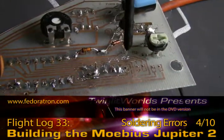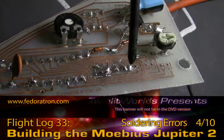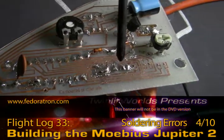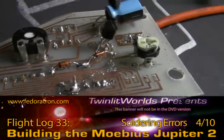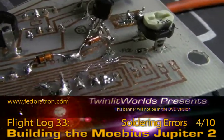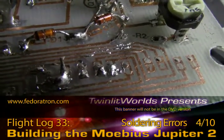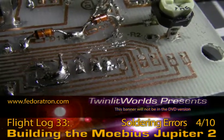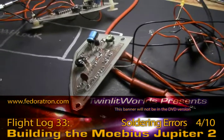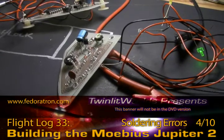It turns out what I had done wrong was that number five right there, which is the reset jumper lead, had a little bit of solder sitting on jumper six, so it was treating six as the return and five as if it was a blank LED. You can see a little bit of solder on number six that was actually connected to number five. I did boards one and two at the same time, hoping I'd get similar results, but it definitely didn't work out that way.